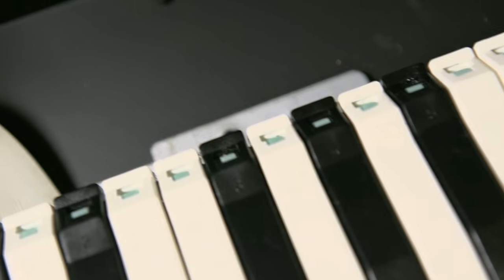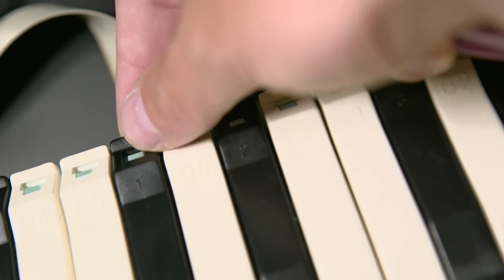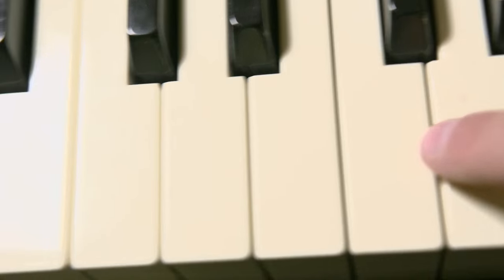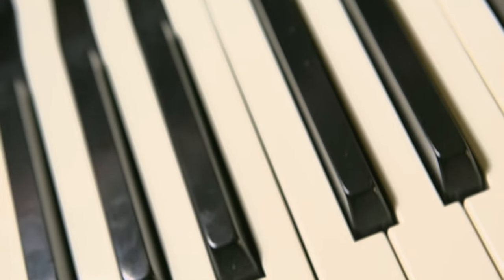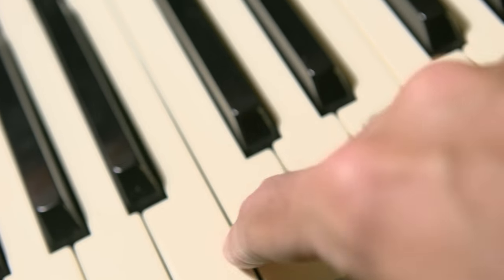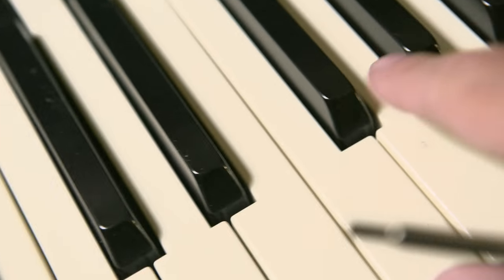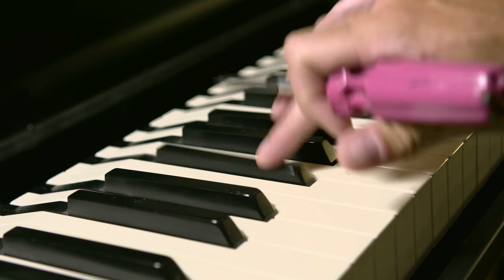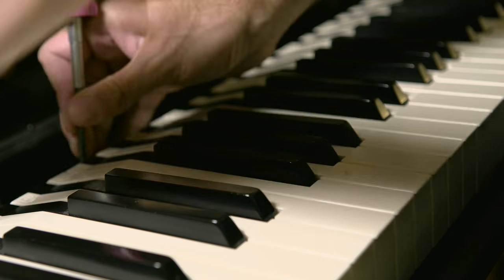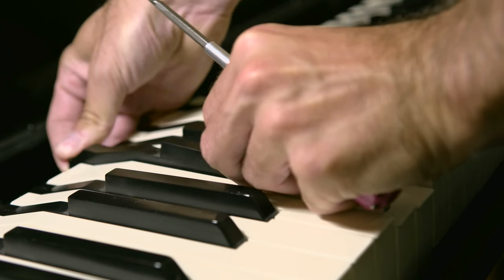In this model there is a little plastic piece back here. We are going to stick the screwdriver in, push, and then we can just lift this key up. For the black keys you don't need to remove the keybed from your controller case. We're just going to focus on the black keys because oddly none of the white keys have this issue. Here we go — push in on this mechanism and up comes the key.